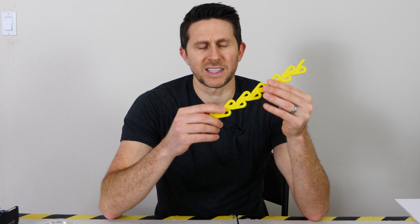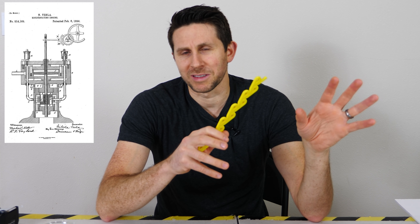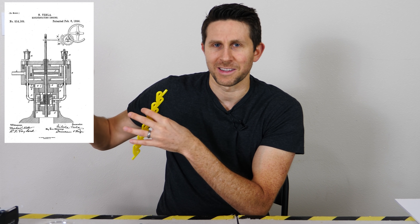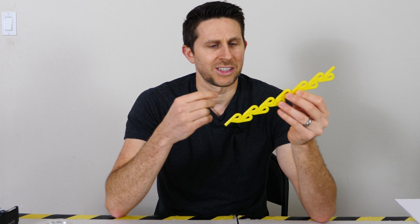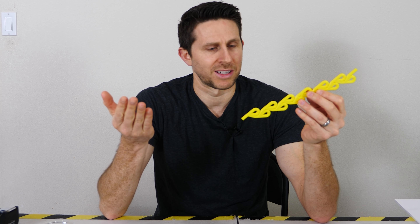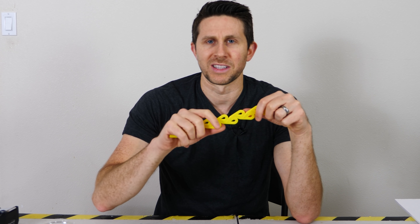It's possible that Tesla might have experimented using these Tesla valves in his oscillating machine to generate power. This oscillating machine is also called his earthquake machine — he famously showed that he could find the resonant frequency of buildings and cause them to shake at the right frequency, making the whole building start to sway and almost fall over. In high-oscillating systems like this, you can't have any mechanical moving part because of the extremely high frequencies — it'll break really easily. So you need something without mechanical parts, like the Tesla valve, and even though it allows some backflow, it still has that pressure delta that ends up being useful.